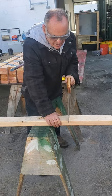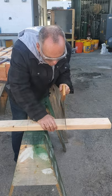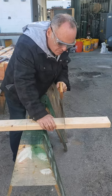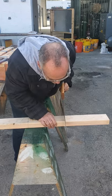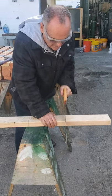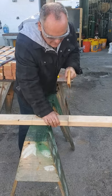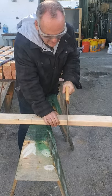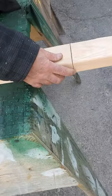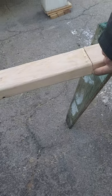Okay, so here we go. I've got my notch. Every once in a while, blow away the sawdust, check your lines, make sure your blade's on your lines. As you can see, I went right over the pencil mark with my saw on the side and on top. Now I just have to pay attention — I can see I'm going a little bit crooked over there, so I have to straighten that out coming down.